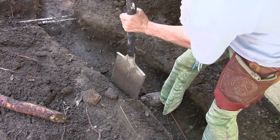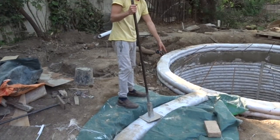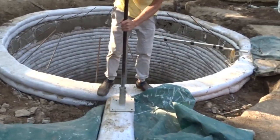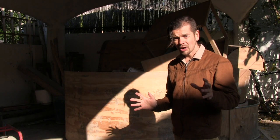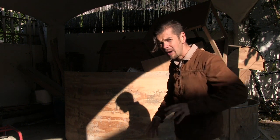Then we'll go to foundation work. I'll teach you how to dig the trenches and how to keep them waterproof so the capillary action does not siphon up your wall. I will teach you how to make these robust archway forms for your sandbag dome,